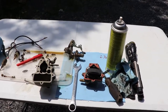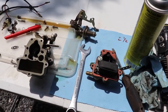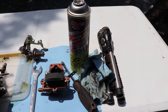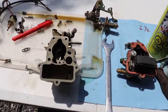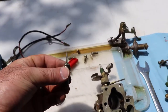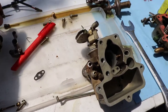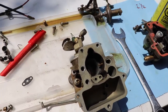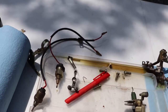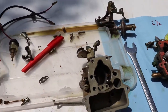I'm doing a bit of work on the carburetor for the forklift here, just checking it out and cleaning it up as we go. I just have a bit of carbon choke cleaner. There's not really much for O-rings in this — I would have thought there'd be one on the needle, down in the hole where it came out, but I haven't seen one. There's got to be one in there somewhere to keep it sealed. The only real measurement you need to do is to lightly bottom it out — I found mine was two and a half turns out.